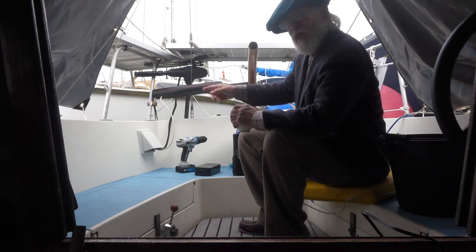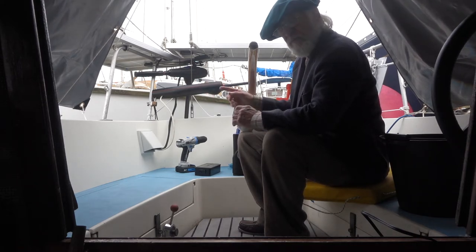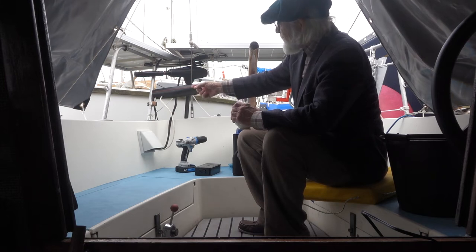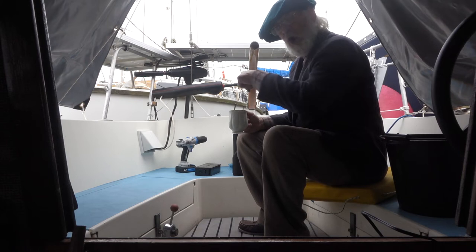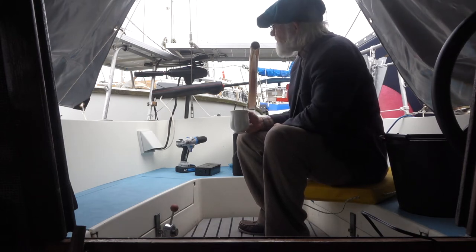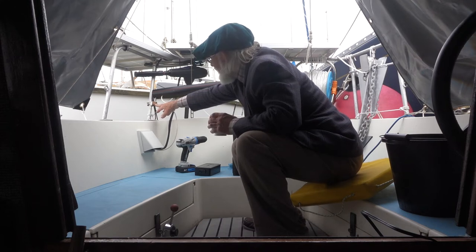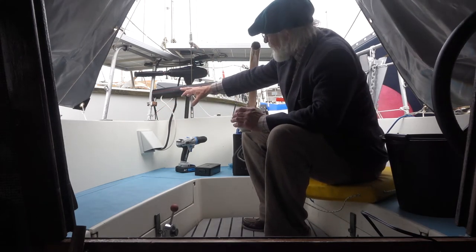The arrangement over there was a little bit difficult. What I've done is put some stainless steel hose clamps around the upright there, and bent a little bit of aluminium. When I drilled the hole in the aluminium to take the piece that the pin goes into, it came out a bit loose. So I drilled a tighter hole in a very solid piece of mahogany wood here, it's not going to break, and I then clamped that together.